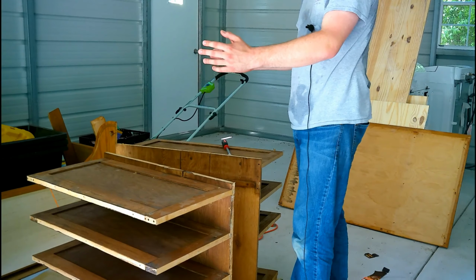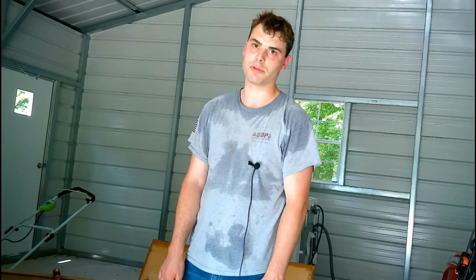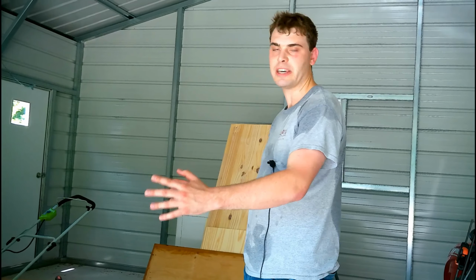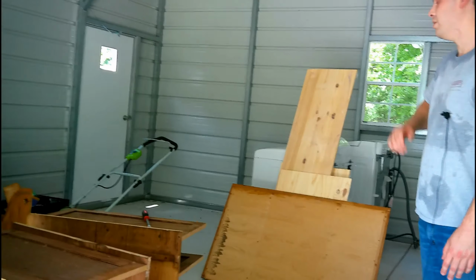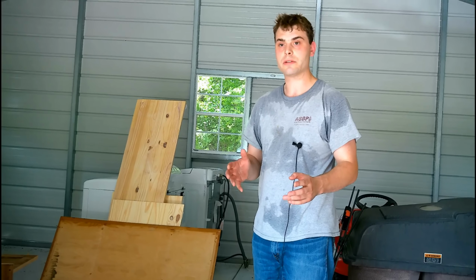So basically, anytime you would attempt to move it, the top would be forcing these two portions away from each other, but that would be the only thing forcing those two portions away from each other. If you've ever owned any desk made in IKEA, you would understand that that is not a very good answer. Especially when the two sides are extremely heavy. If it was something like a table design, where you only have four very skinny legs, maybe less than 3 inches in one direction, then that would be fine. But because we've got basically filing cabinets on either side of a solid piece of wood top, it's simply not going to work. In addition to that, many of you may not have noticed, but some of you may have, that wood that's going to replace the top is not a solid piece. It's also not an extremely high quality piece. That is pine.